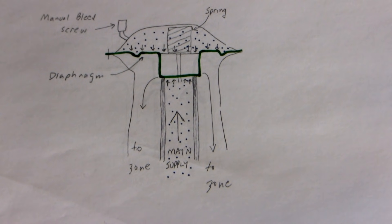These diaphragms all have a small pathway that allows water to trickle over to the other side of the valve, to the top part of the valve — I've shown that pathway right here. Water will flow along that narrow pathway until you have equal pressure on each side of the valve, but here's the deal: the area of the valve exposed to water pressure on the top is much larger than the area below.